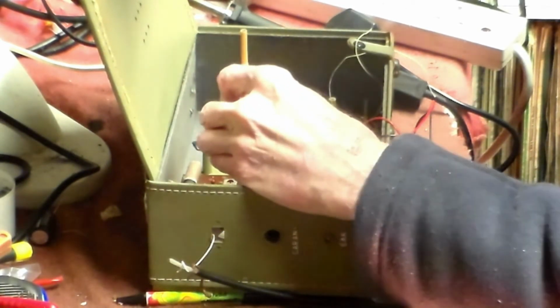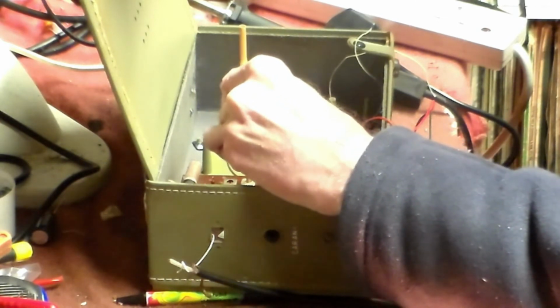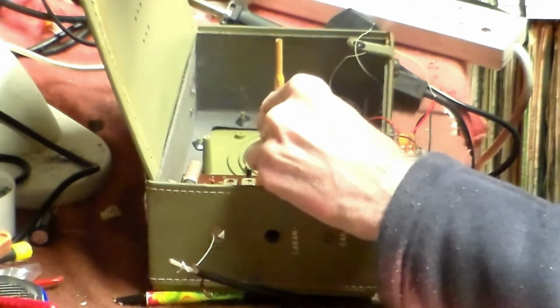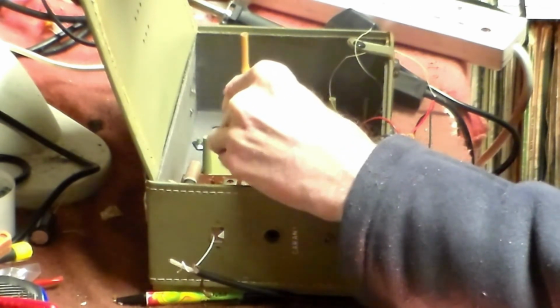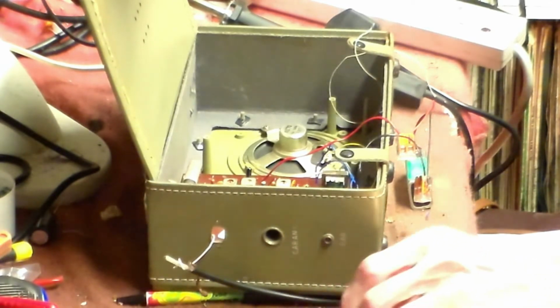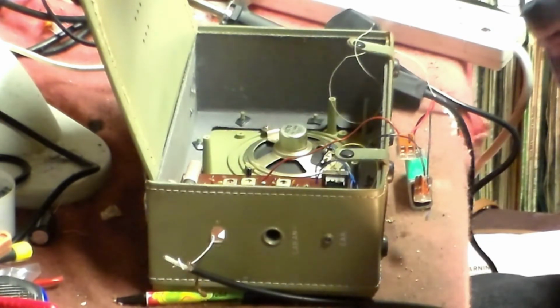And then you tune up the IF, only the IF ones, not the oscillator, only the IF ones, for maximum. That one, the right one, in that order. The back one. Okay. Do it several times. And get it on frequency. By the way, always have two generators if you can. Because if you put the signal high up, the AGC kicks in, and it doesn't do it properly. So always keep it as low down as you can, okay?